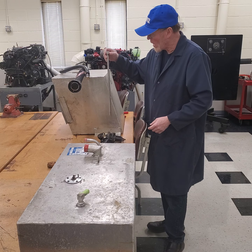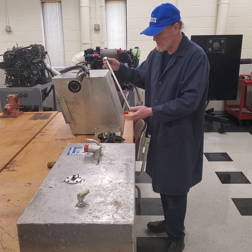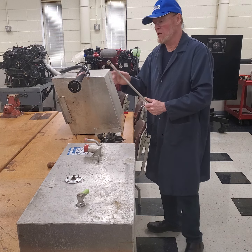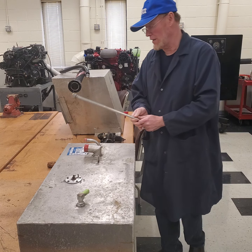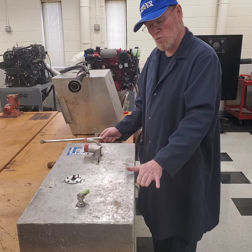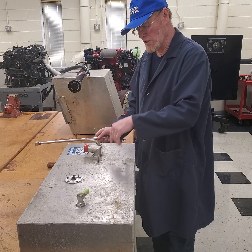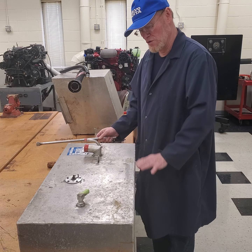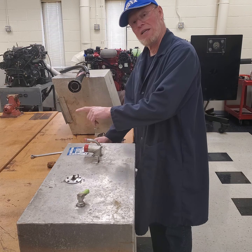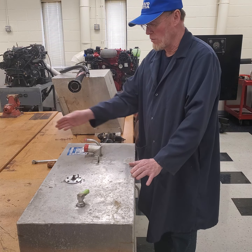How far off the bottom of the tank would this fitting be? About a half an inch. It's important that this is manufactured by the tank manufacturer because it has to be at the right height. All fuel tanks are rated for five percent expansion, which means when you fill up the tank, the fuel stops going in and comes out the vent — giving you a five percent expansion range so the fuel won't keep going out the vent.